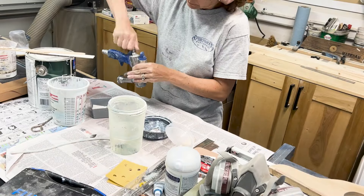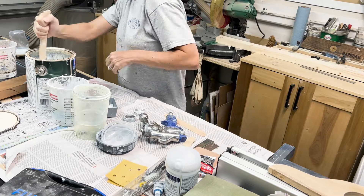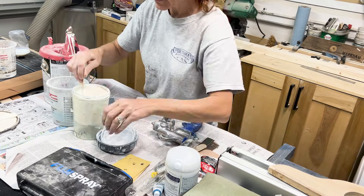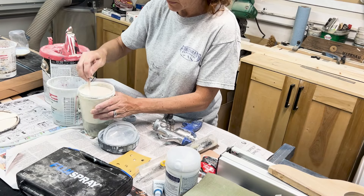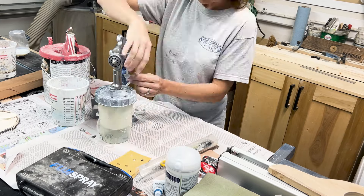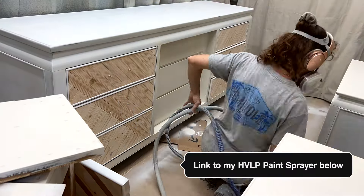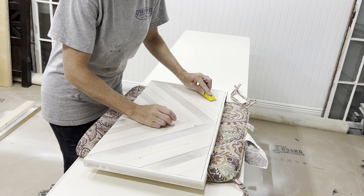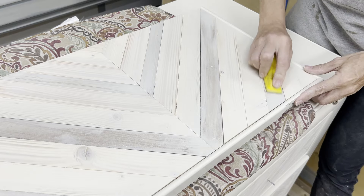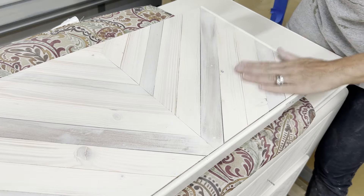I'm a full-time furniture builder and refinisher, but when I was starting out I painted pieces with chalk paint and brushed by hand. If you're just doing small projects, I recommend investing in good brushes and paint made to be applied by hand. But if you're planning on doing several pieces, a big project, or turning this into a hobby or side hustle, I'd recommend a paint sprayer. For the cabinet doors and drawer fronts, I wanted to see a lot of the wood grain, so I applied very light coats of paint on those areas, then sanded back by hand with 220-grit sandpaper when it dried.